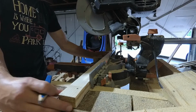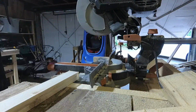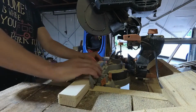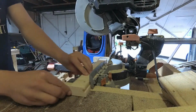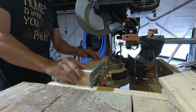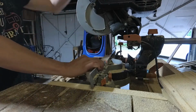So the shelf itself will be a total of 400mm in height, and then it will be wider than 20mm in width, because the vertical boards will actually be on the outside. I'm not mitering anything here. I was looking for a quick build, something that I could do within an hour. So once I've measured those to length, give them a quick chop, and then it's on to everybody's favourite part, sanding again.